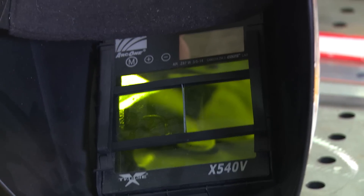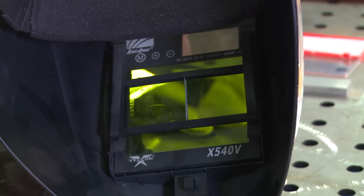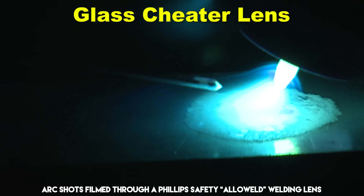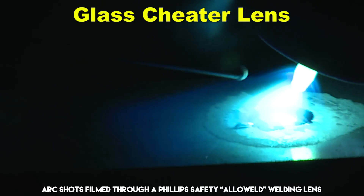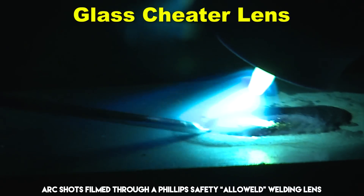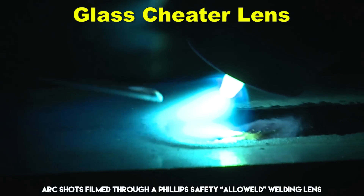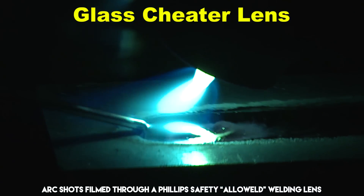Now I'm going to put my 2.0 powered lens in — but it's the glass one. Hopefully you can see the difference as well as I can. So I'm looking at this and it's absolutely more clear than the plastic. Trying to break through all these nasty oxides, but it's doing it. Definitely an improvement. I'm going to go ahead and taper off and back off on my amps.